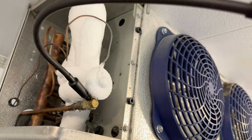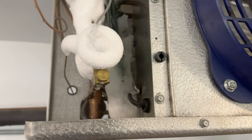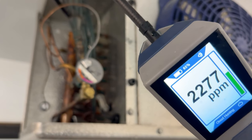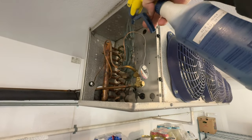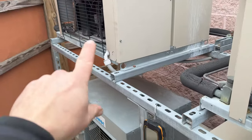My question is whether it's leaking right there on that piece - very good possibility. We've got some blazing hot water here that should melt the frost in a short duration of time. Some hoober goobers there - somebody didn't know how to braze. Holy mackerel, look at that - that is an abomination to pipe fitters. I think there might be a leak in this distributor too. Coming down here with the liquid refrigerant spray - oh yeah, right there it is. Worst possible location you could ask for - right in the distributor tube.